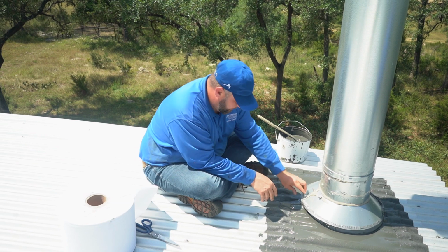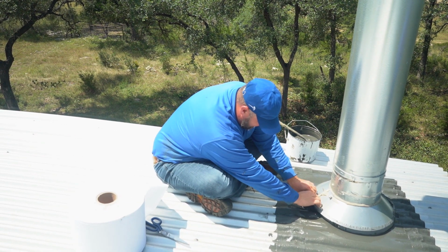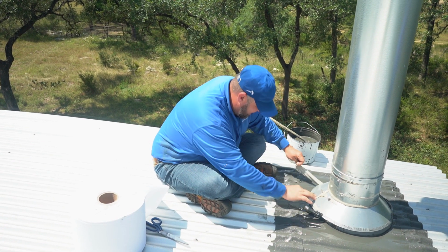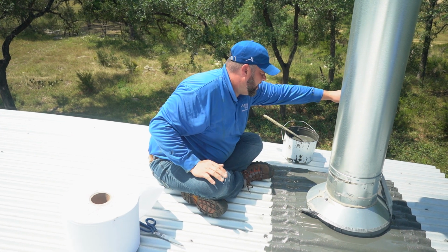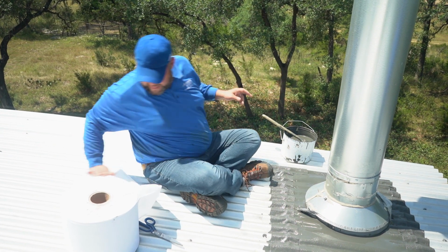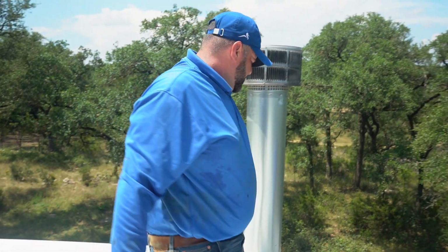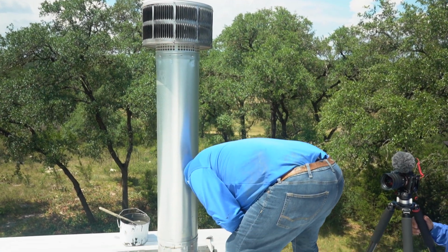What I like about it is that this product comes in a 1-gallon bucket. So theoretically you could have one of your guys with it in their truck with some fleece and a couple of roller covers, and they could go out and do their flashing and be done. The other product, once you catalyze it, because it is a 2-component, has a pot life, and when that pot life's over, that material's gone. So you can put the lid back on this and take it to another job.